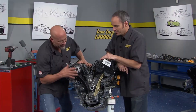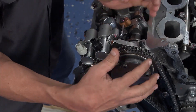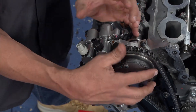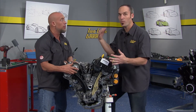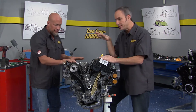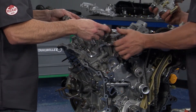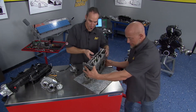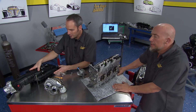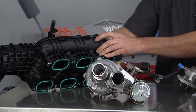You can see we're making some good progress — we've got some covers off. You can start seeing the cams, this wild cam drive up here, and we can see into the ports. Really cool to see some of this stuff exposed — cam phasers and the oil solenoids that drive those things. These rotate the camshafts according to the crank angle so you can advance or retard the camshafts depending on where you want it — while you're injecting, while you're boosting, while you're sparking. Amazing how this all comes together as a technology bundle. We're going to drive deeper — pull the cam drive off, pop the head off so we can really see the injectors. Now this is EcoBoost. We've got an intake manifold with short runners because you don't need tuning length when you've got a turbo for boost and power. And — no injectors in the port.